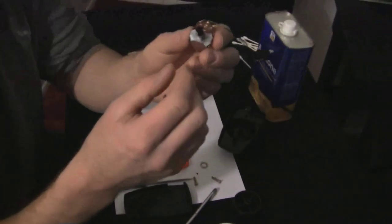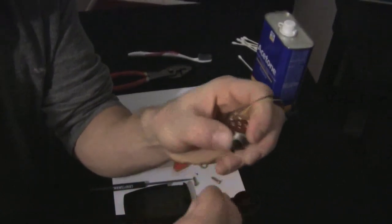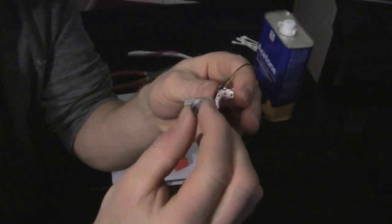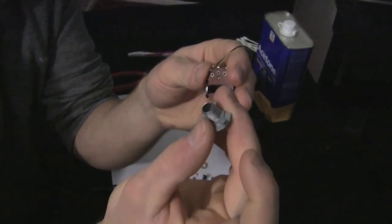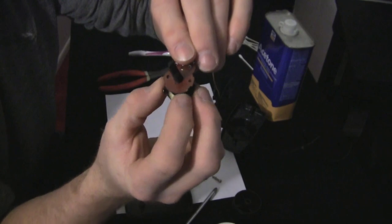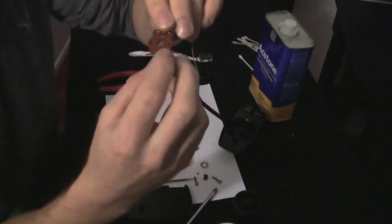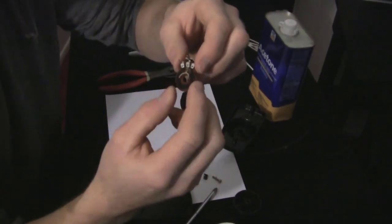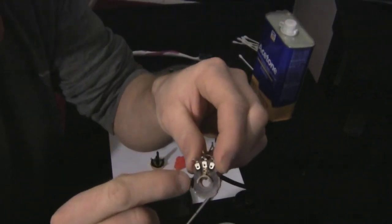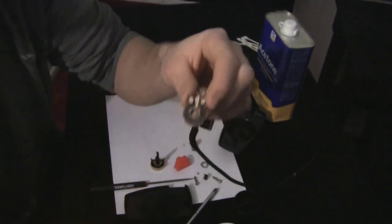Now that your tabs are up, you can pull this threaded metal sleeve off. You've also got to remove that metal clip that was on the end of the plastic. Pull this threaded metal sleeve — this retainer plate — off. Then you can pull off the plastic board. You'll notice this board has a metal contact surface around here. It's black, and it normally is black — it's not just dirty. And these two metal prongs right here — these are the contacts that you want to clean.